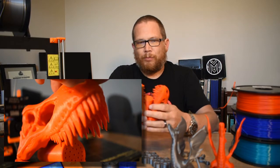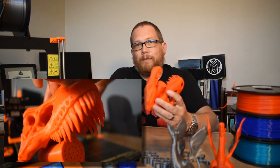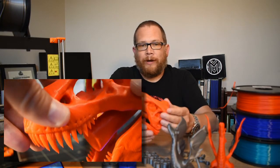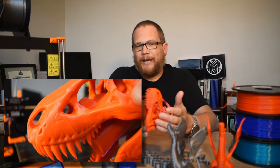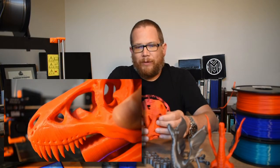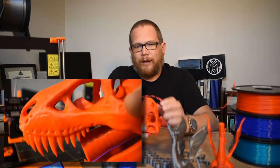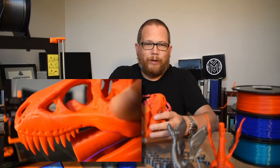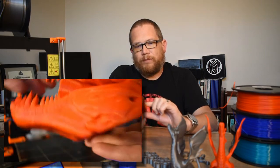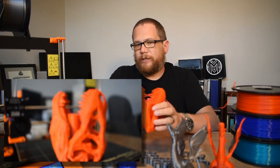What I had done was go from 0.15mm layers down to 0.1mm layer height because I really wanted it to look good — that was my first attempt at messing with settings. But it really layered a lot. I was watching it print because it took 30 hours, and I noticed something underneath my carriage.